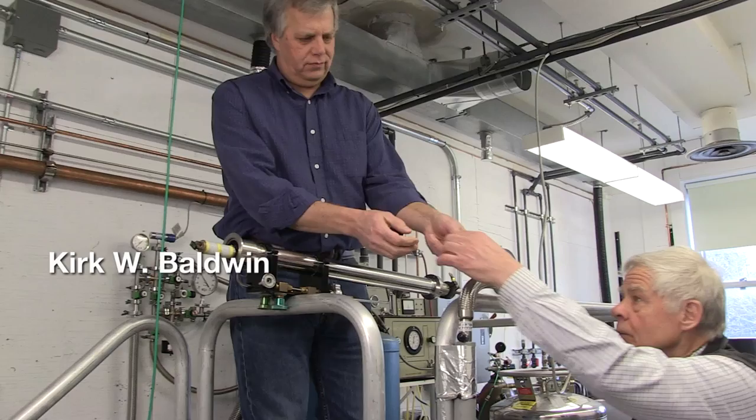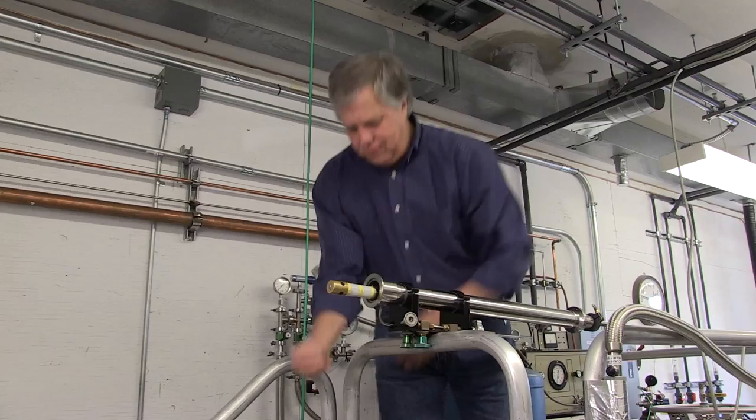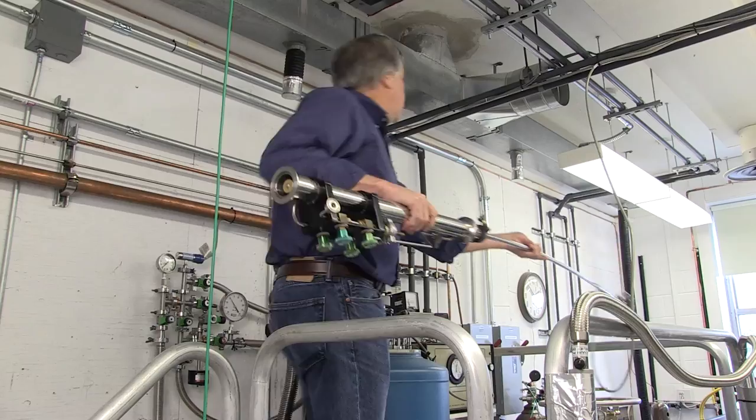I think the checking of the quality is extremely important. Our proxy for quality and purity is mobility of the electrons in a two-dimensional system. We test that by putting a small voltage across a known sample and measuring essentially the velocity of the electrons. The higher the velocity, the higher the mobility.